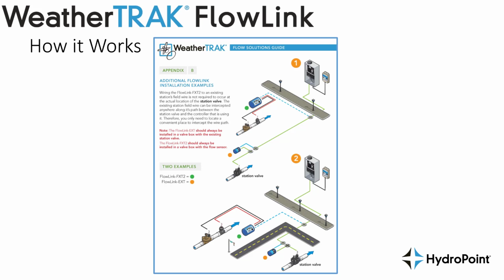Also available in the Flow Solutions Guide are alternative EXT wiring diagrams that detail how to capture that valve wire in the middle of the wire run rather than in the valve box. So if the valve wire runs right by where you want to install, or you have other site challenges that might make it easier to capture the wire in the middle of the run rather than in the valve box, check the Flow Solutions Guide for a wiring diagram.